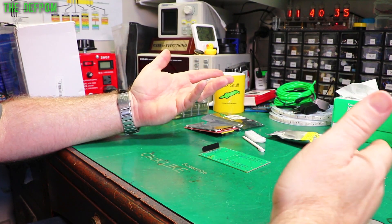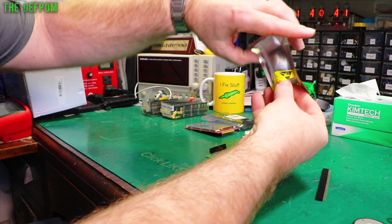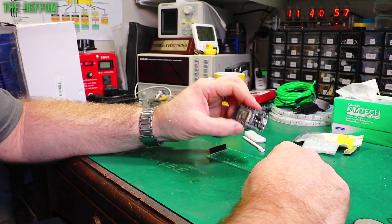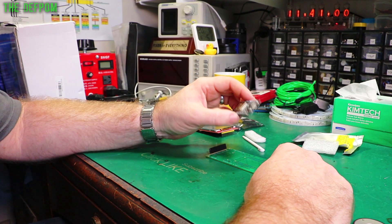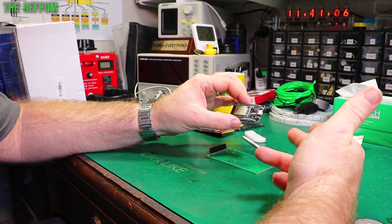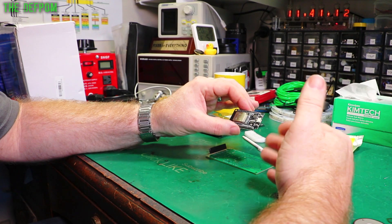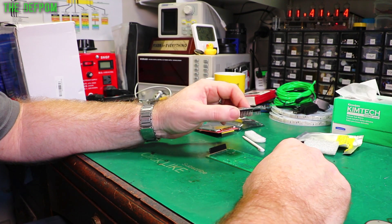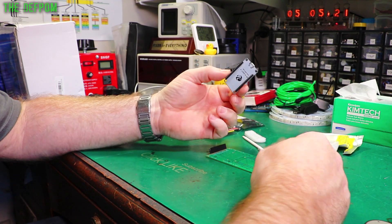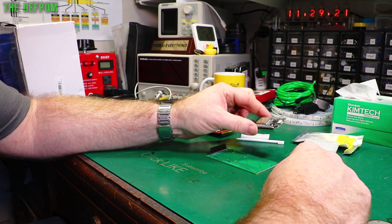In regards to powering this thing, you could use the USB cable plugged straight into the ESP32 — it's already got a USB Micro socket built in. The thing is, when the ESP32 uses WiFi, which you do use on this project to program it and set key combinations, it can draw up to an amp, so you might find some power starvation. It's unlikely, but it may be an issue depending on your system. That's probably going to be my backup solution.